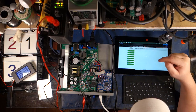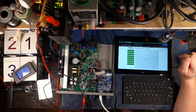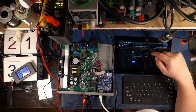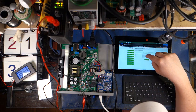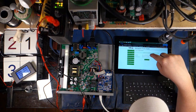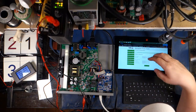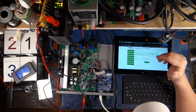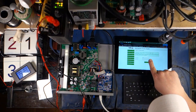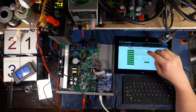Let's go to user config. Set new user credentials. Network config — you can set this for DHCP, has a MAC address, host name — that's handy. SNMP configs — we can have three communities in here, and SNMP v2. There's a lot of software in this little bad boy. Watchdog configs — set up the outputs to act according to IP address monitoring. Three attempts will be made before sending the reset command to the configured output. Ping timeout is set to five seconds. The period between each ping is set in minutes. So this thing is a ping watchdog — sweet.